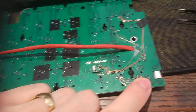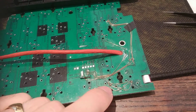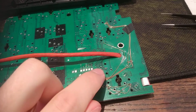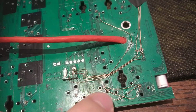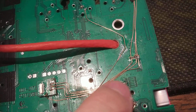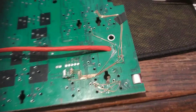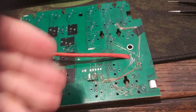this light from the right arrow key wasn't working, so I took the signal from the key next to it, but then it was working at the same color as this one on top. So to force it, I also had to use the plus from this light to here, and what I did is a little modification that was simpler. Right here I cut the trace and then soldered those 2 traces together. I cut it with a cutter, alright. Then all lights were working, so I did it in this order, but whatever.